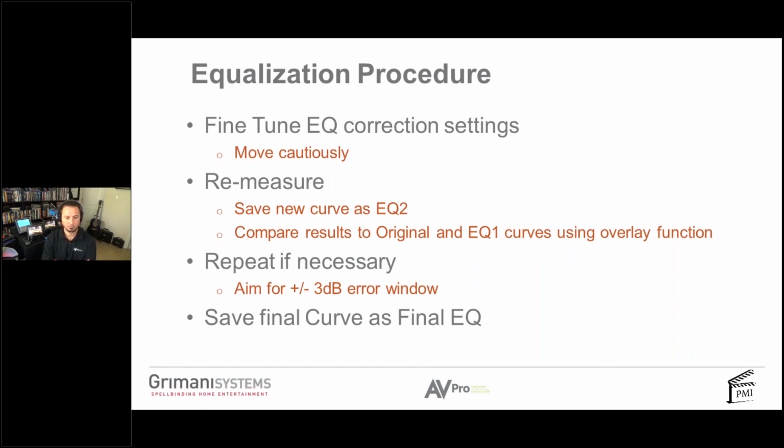Cool. With some of the audio EQ systems, you measure once, tell it to do its thing once, and you get one result. If you measure the result with your own analyzer and push the button again, you get a different result. You push the button again, you get a different result. That's a bad auto EQ system. Some of the better ones behave just like the DCI grade video ones, where you give it the red, green, blue, and white, and bam, it gets exactly down to the target perfectly. So it's a little bit all over the place.